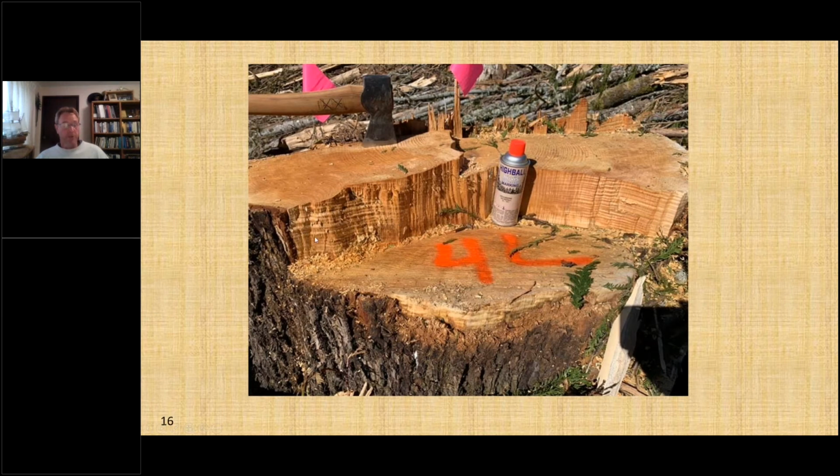The thing is that if this fiddleback actually only goes in 3 or 4 inches, you really aren't going to get into a high value tree. Usually, you look at maybe wanting to see figure go a hand width or 8, 9, 10 inches deep into a tree, and then you're getting a lot that you can work with.